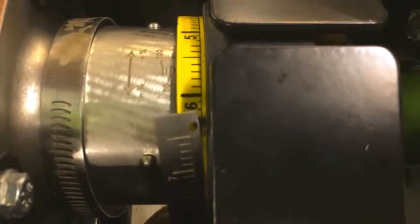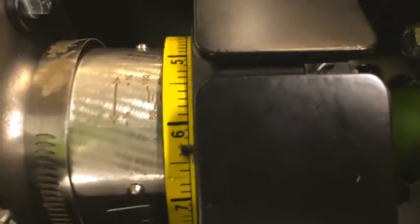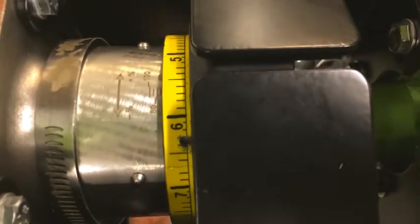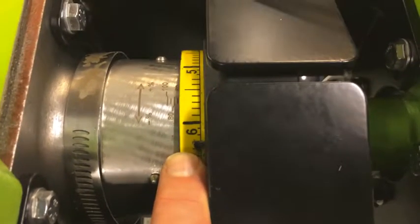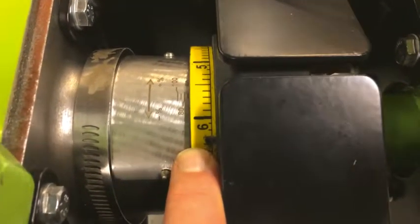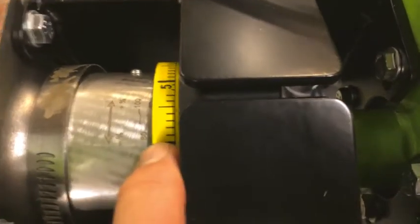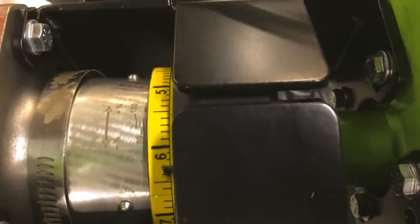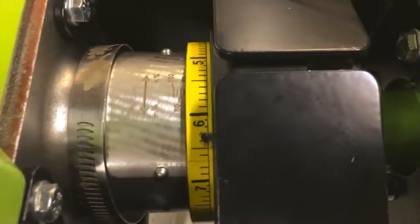There's that hole. So now when I wrap this band around, both ends will overlap that hole, which I can't do one-handed. Both ends of the band will overlap that one hole, and then we'll put the drive rivet through both bands, and that will hold the band in the proper position on the knob and together on the knob so it won't fall off.